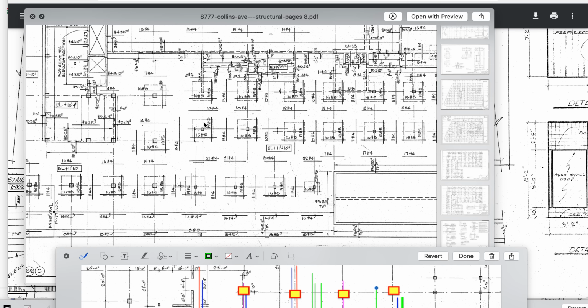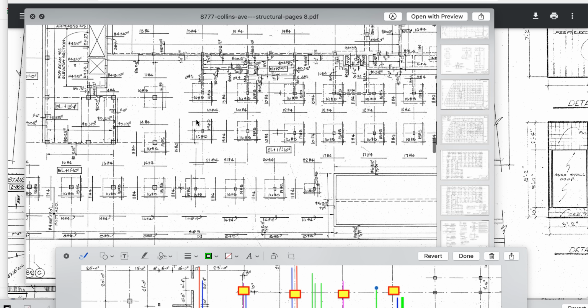I'm very specific about saying this drawing because not all drawings have puncture protection written up like that. So, in this drawing of 11 foot 10 and 11 foot 10, the pool deck and the parking garage are the same elevation. They show that the reinforcement is of such. If you scale this, you might come up to 3 foot out there, 4 foot out there, and 4 foot this way. Okay, all the way around there.